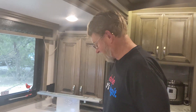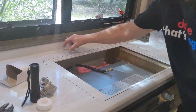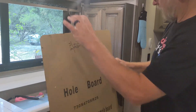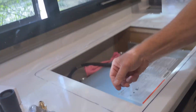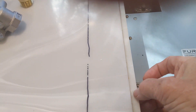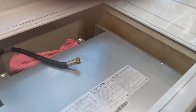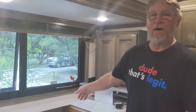Measure twice, cut once — you've heard of that. I made multiple measurements, so this is going to give us enough room to put our vent back here across the back, tied into the oven. These are our cut lines right here, and they give you a nice little cutout template. We are not putting it under the counter or sinking it into the counter — it's going to be flush mount, not countersunk. Because the other one laid in here and there was always a gap you couldn't clean. You can see the dirt and you can't get it out because you've got to lift the cooktop out. We are not messy people — it will be much cleaner and more sanitary after this.